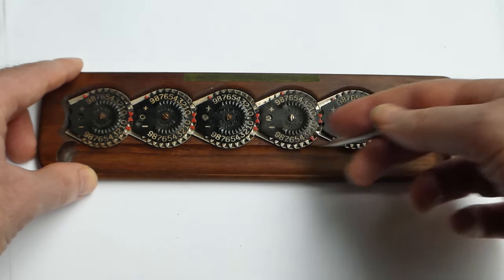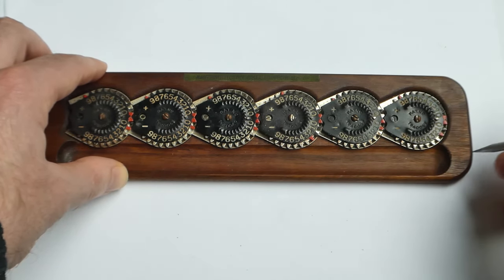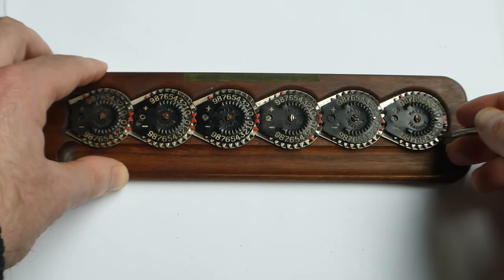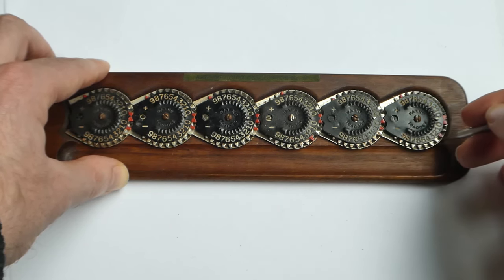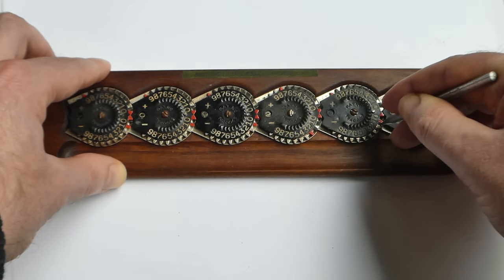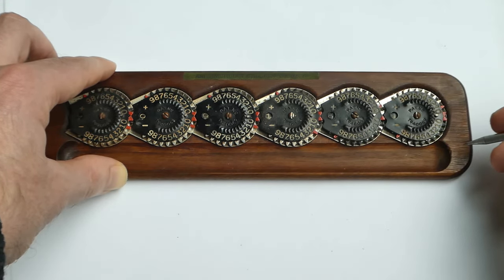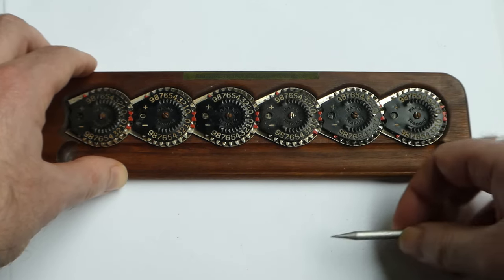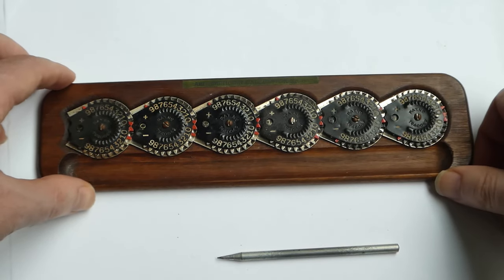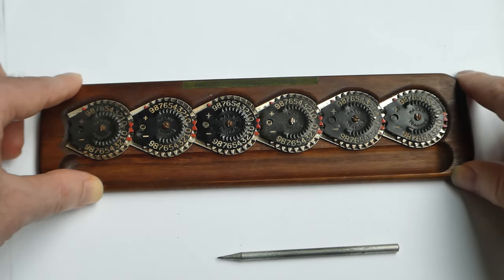Subtraction is done on the underside at the bottom of these gears, and that works the same way. To subtract 2, I would do it here, but I'm between these silver teeth, so I have to go this way. The carry can't be performed on this digit, so I have to go right down to the next digit. And there we go — 199. Another nice feature is the clearing mechanism: just rub your finger all along the bottom to move the gears to zero.